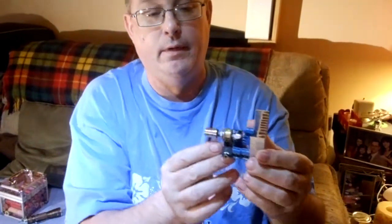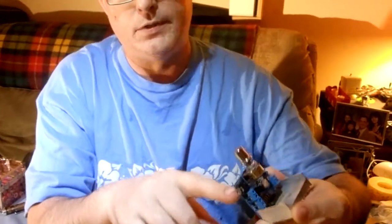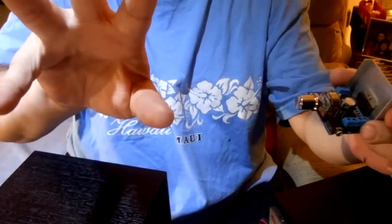To be honest with you, the amp board had a 3.5 millimeter input, stereo, like a mini headphone jack input. So I had a cable, and I pulled the end off of one. There were the 3 wires. I tinned them, and I plugged that into the input, and then off the 3 strays, I went onto the MP3 board where the connections were for the connector, and I just soldered it on the bottom of the board. So that was how I chose to do that.